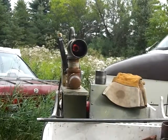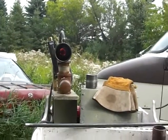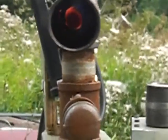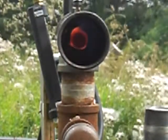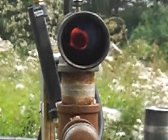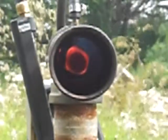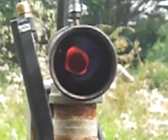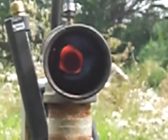The side one is kind of taking away part of the heat. I'm going to try to go in closer. I'm using about a little more than average propane, and my air setting is set at about 35% air. You can see the flame kind of spinning — you can see the out-point of the wire. The glow is actually the stainless steel wire, and the three-eighths pipe itself is a semi-transparent orange. You can see the hot spots of the steel pipe.